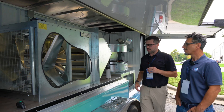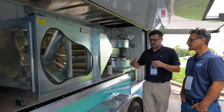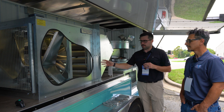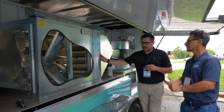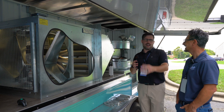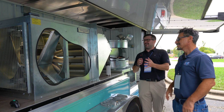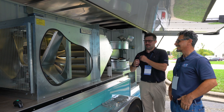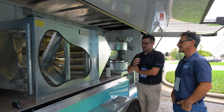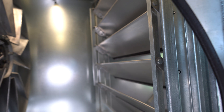This one is pretty popular today — super popular. EC motors are becoming more popular, not only in fans, but in make-up air units and all of the HVAC equipment we see throughout the industry. No belts, high efficiency, low maintenance. Nothing turns off an HVAC owner like high maintenance. This is very minimal maintenance. But I totally get what you're saying because when there's not a belt and these are up on a roof in a place where people aren't there often, going up there to check belts and change belts is a big pain. So I'm a big fan of the direct drive.